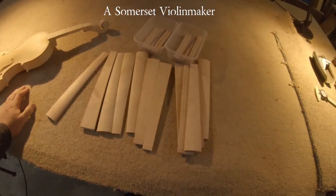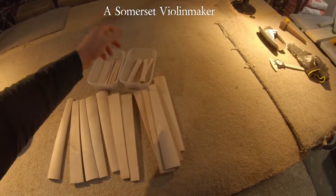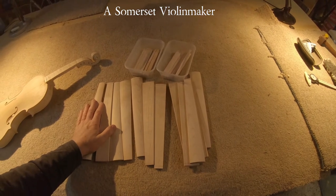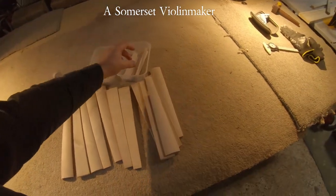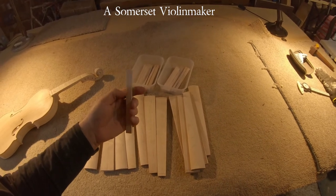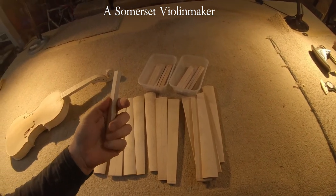I think the most sensible thing to do in the first instance is to cut these down to something nearer the actual size I want, or maybe start with a piece of scrap — probably most sensible of all — stain it, finish it with cyanoacrylate, and just see how tough it is and how far into the surface it has gone, and whether I think it's a viable option or not.